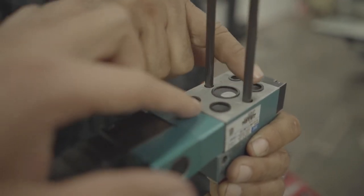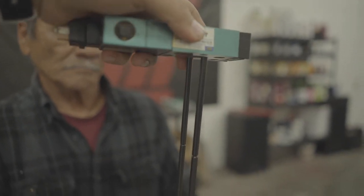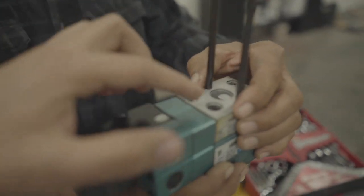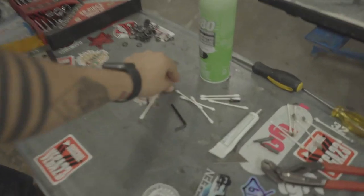My father-in-law left and my dad's here to help me hold them on their side. Here we have the gaskets — the ones that get sandwiched in between each valve. What I'm going to do is come over here, grab the next one that goes in, and basically just slide it in place so the gaskets sit where they're supposed to. Then we grab the next five from that bunch, put them in here, and slide them all the way through. Screw those together so everything is held in place. After that, we put it back on the press to fire it up and see if we have any leaks.